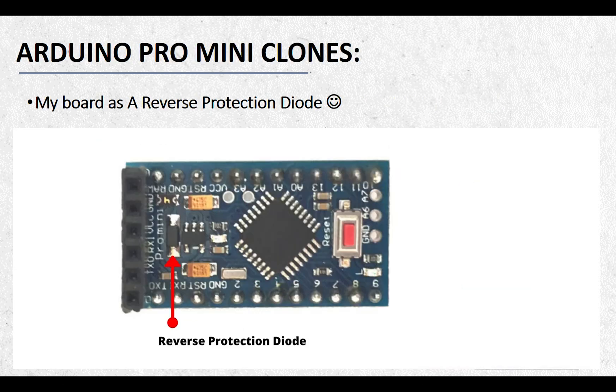I have a Chinese clone of the Arduino Pro Mini and it has an onboard diode. The input of the diode is connected to the RAW pin and the output is connected to the input of the voltage regulator. This is for reverse protection — it protects your Arduino board from reverse voltage. In the absence of this diode, the tantalum capacitor at the input would become short if a reverse voltage is applied, which would probably short the voltage source. Almost all of the clones have similar schematics and they are equally capable.